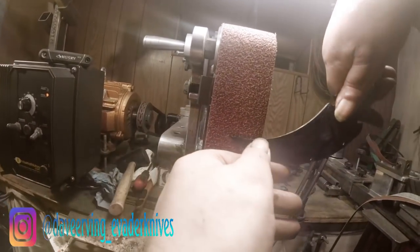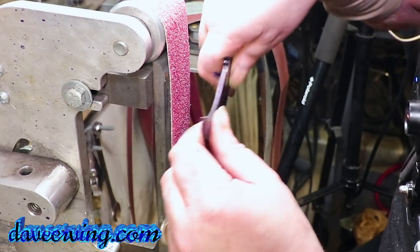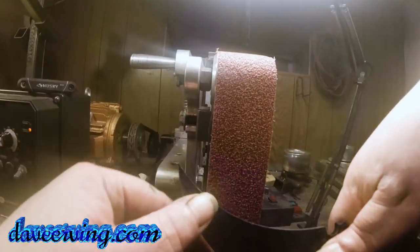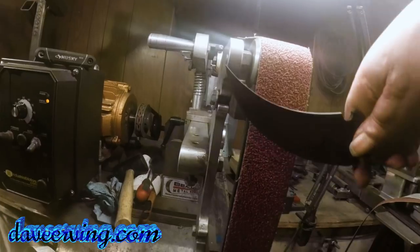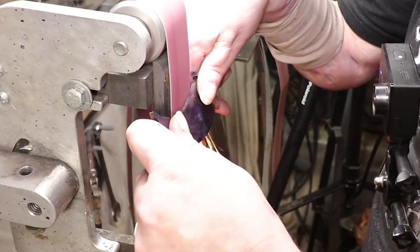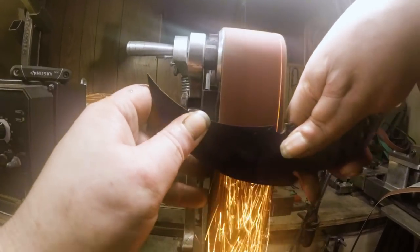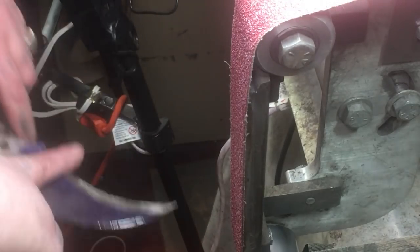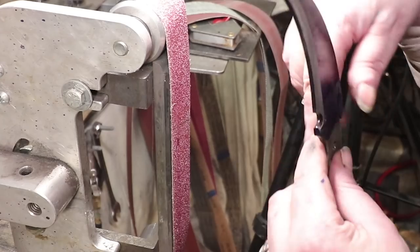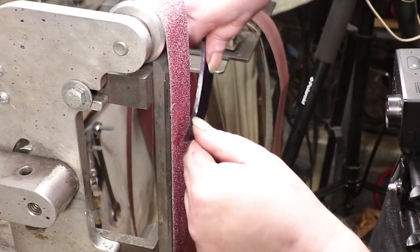No hanging over — we're going to have to do this all off the edge. The only difference between this and the hollow grind is I won't have to pull up; I can keep everything kind of straight. With the hollow grind I had to worry about how the hollow was coming out, but it's still going to be kind of difficult. I forgot this was a worn belt and I'm just breaking the 90s. It seems like breaking the 90s is the hardest part — once you get going it seems like it's going to be okay.